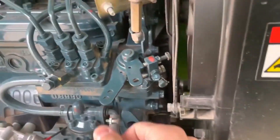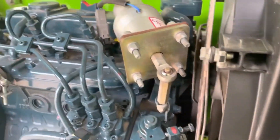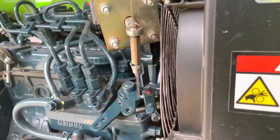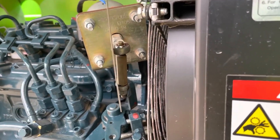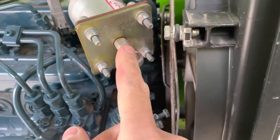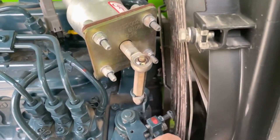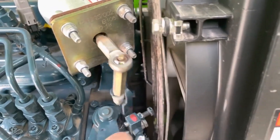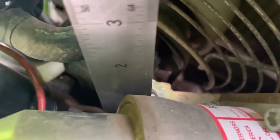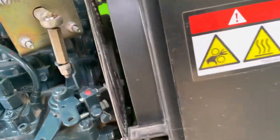So that's where it should be for the engine stop — most important are that spring and that bolt adjustment. The next thing is the alignment of the solenoid itself. As you can see, it's currently off-square. I'd like this linkage sitting straight. If it's misaligned, the side force on the shaft will prevent free movement of the solenoid. I can hear a squeaking noise which is likely caused by this misalignment. I'll loosen this top bolt and twist the solenoid bracket to correct it.